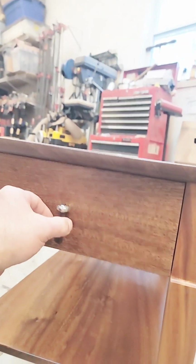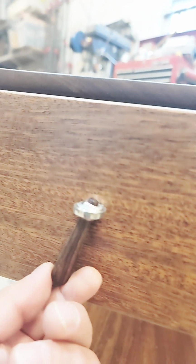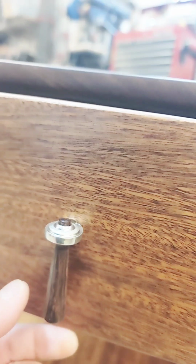And here's kind of like a little, it's twofold. It is structural. There's a sliding dovetail that connects this piece to these legs, and also it acts as a stop, a reference stop for the drawer. So I'm super happy with this. I'm really happy with this. This is a beautiful rosewood that I friction fit into this tie rod. This is a McMaster part.